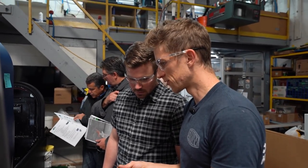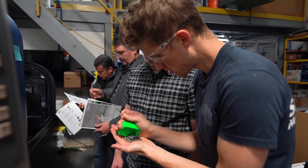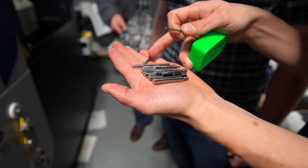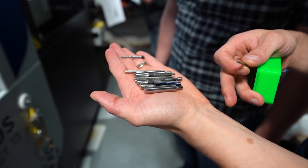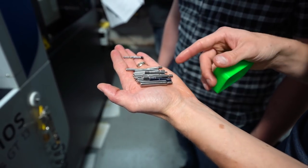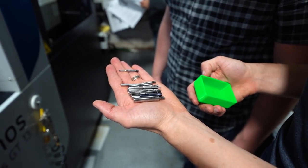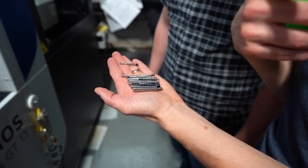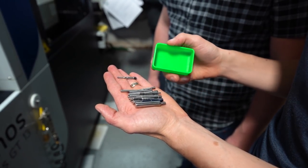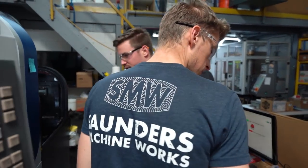Okay. Is this the factory one in here? It comes with this one that I just ground down until it fit my part. And then I figured, oh, I'll just make it. You can make it, yeah. Yeah. And I made them out of titanium and anodized it blue because why not? That's pretty cool. So I actually made these on the Nakamura and just dealt with the deflection and programmed the deflection out of it. Very interesting.